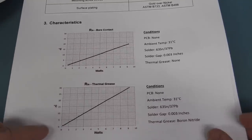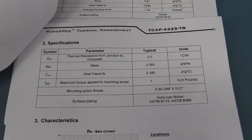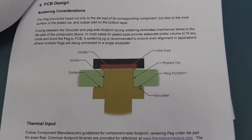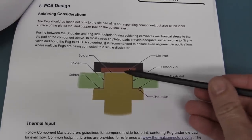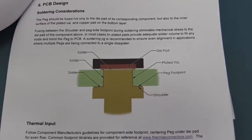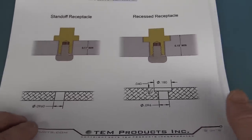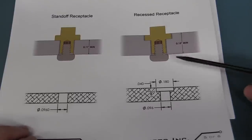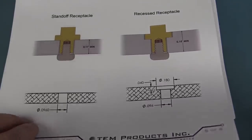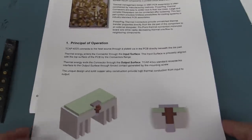There are thermal performance graphs here — looks like with and without thermal grease. 2 degrees C per watt typical thermal resistance junction to the dissipator. Mechanical drawings for those playing along at home. There's your part with your die pad on the bottom going through your board, and then you can put some paste on the bottom side and solder it on the back side of your board. Really quite neat. And then you can mount them stand-off, or recessed of course. You get a full tape and reel package. It's all a very professional product. I love it.